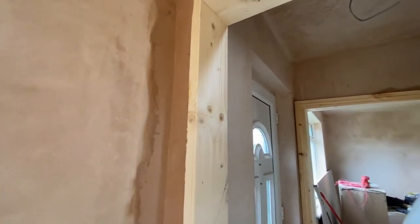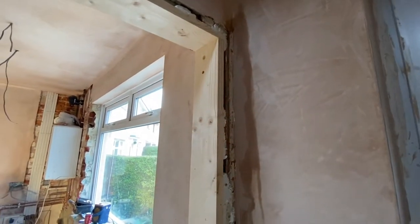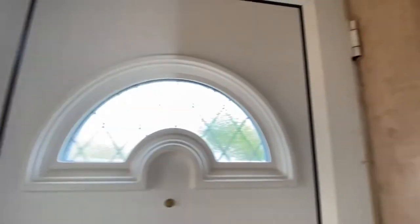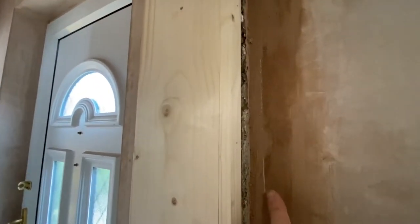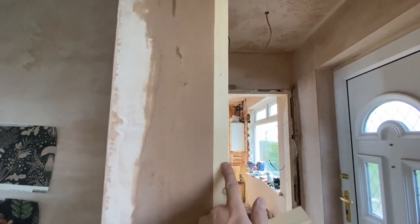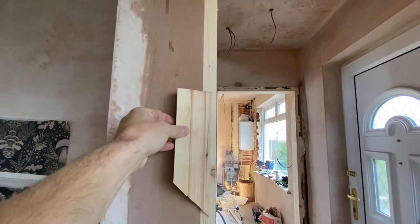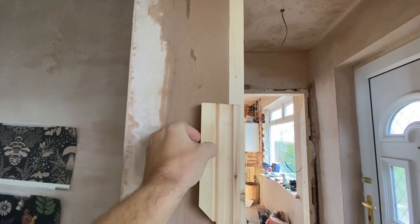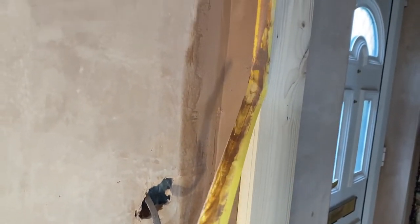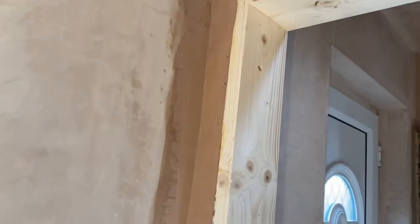Almost every frame had some filling around it — like there, and there, I just fitted this one here. And obviously masking tape here because this would be stained and we don't want to mess up with the dye on the architrave and frames. That plaster here — nice and smooth — it's worth doing. Something to be aware of.